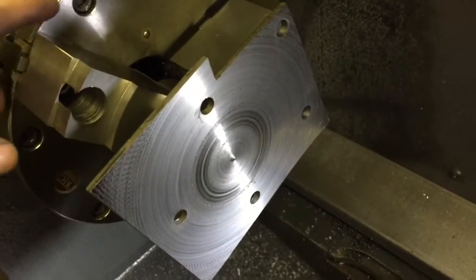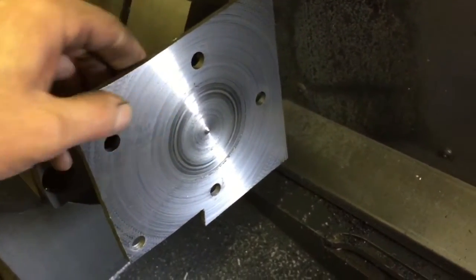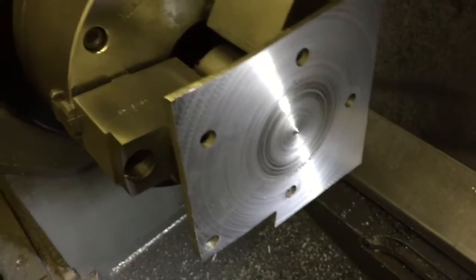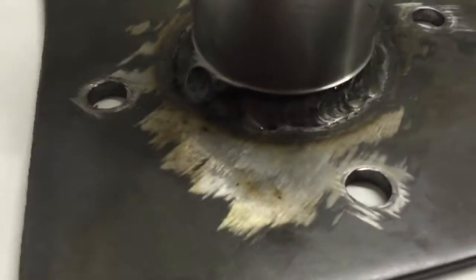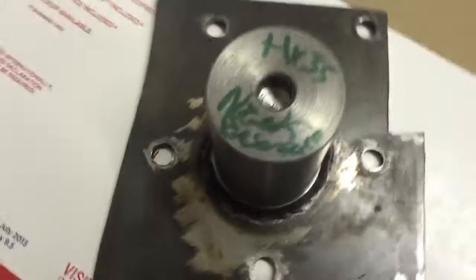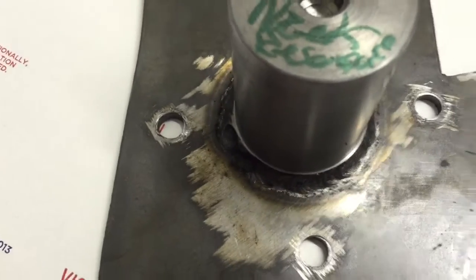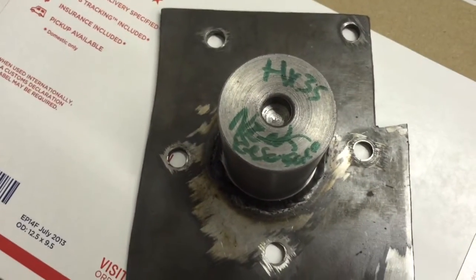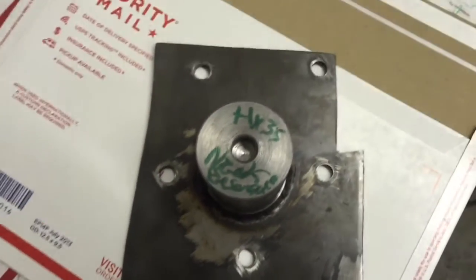Here's what the plate looks like without the housing mounted on it. I just drilled holes and then you can resurface it once you have it bolted on. Here's the other side of the plate. I had to do all the welding and all that — basically cutting, then drilling bolts so it mounts. Then mount the housing on the machine and weld that on there, then machine the plate back down, grab the plate on the machine, and then machine the front.